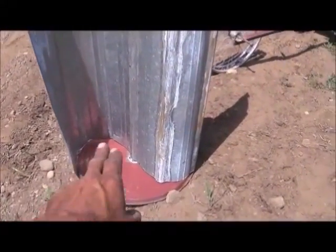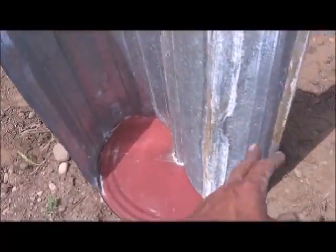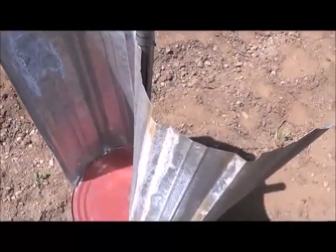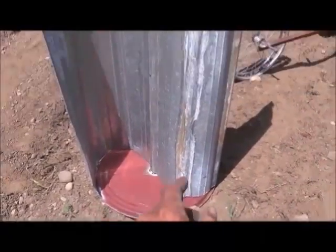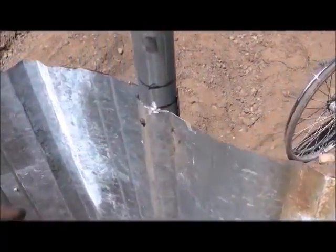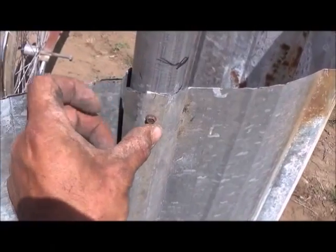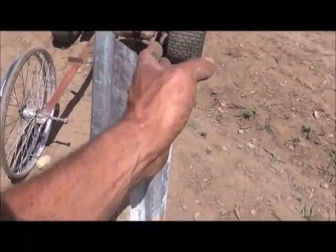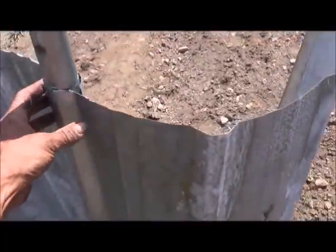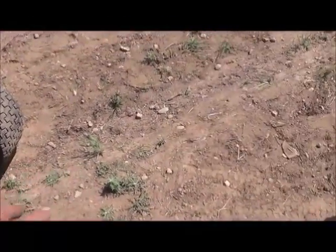Now you can see the wind generator portion of it — it's upside down at the moment. I used a barrel lid for the top, to tack weld these pieces of sheet metal roofing used as blades into a special design. From an above view it looks just like an S. The top is smaller in length across than the bottom, giving more stability, with the wider base closer to the bottom of the frame. This is just a piece of galvanized pipe — the same pipe that went to the satellite dish holder. I took the sheet metal, set it right over the pipe, screwed it on with three screws, bent it around, and did the same on the other side, then tack welded that curve down on the barrel to give us this S-blade design. Let's put that piece inside the holder and start this out in the field to see how well it works.